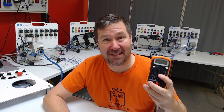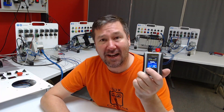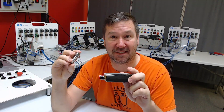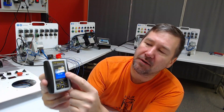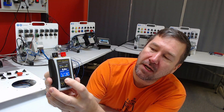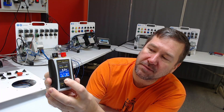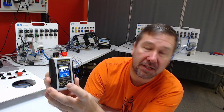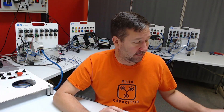All you need is a portable power supply and a basic $10 meter. For my portable power supply, I actually use the PLC Tools SIM ALP2, which we use to simulate the sensor out in the field. It also has a voltage source mode, and in voltage source mode you can power up to 10 volts, which is enough to power up your typical 4 to 20 milliamp sensor.